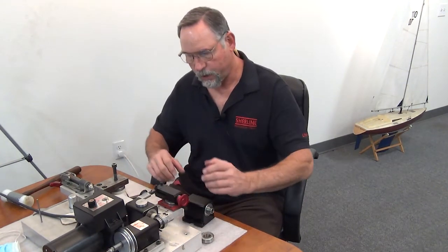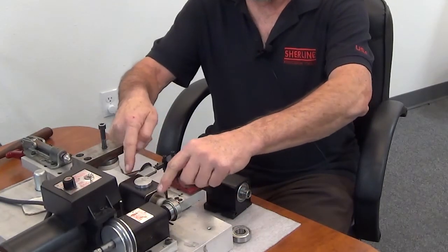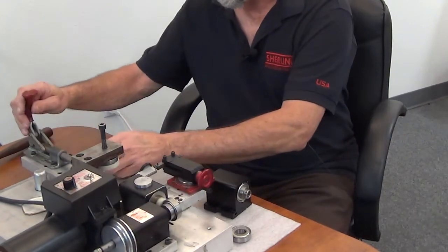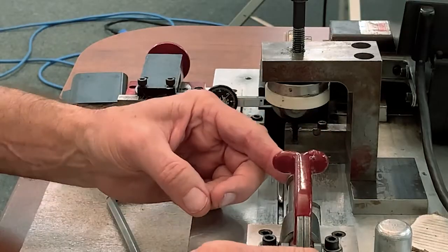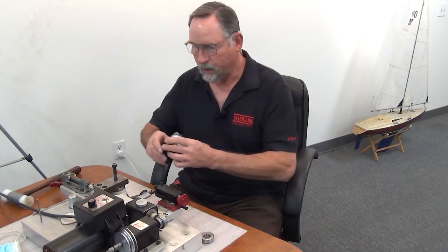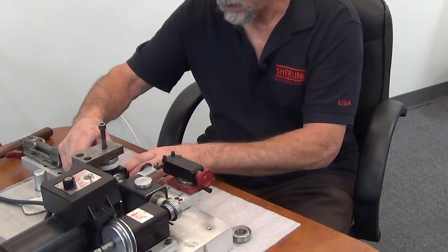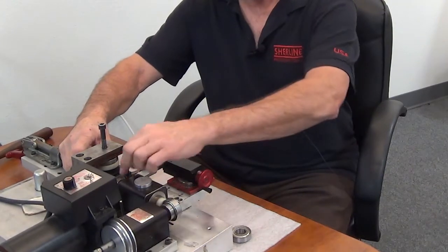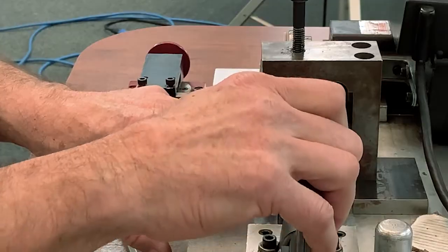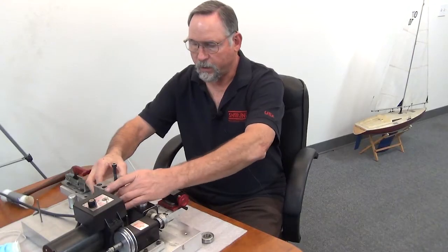This is our fixture right here. What we have is an eccentric — a bearing on an eccentric — and it's pushing on a spindle that's inside this headstock, which moves freely inside a bronze bushing. On this side we have a dead center that is also spring-loaded. My preload nut is currently loose, and I'm going to put it on our fixture up against our floating headstock spindle here, then load it with our spring-loaded dead center on this end and clamp it down in place.